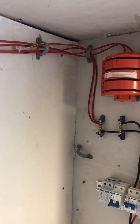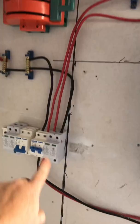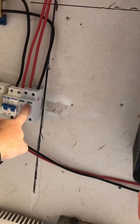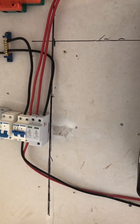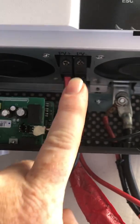My solar power comes in through these four 8-gauge wires here, comes in through this disconnect and feeds into these two breakers. This is a surge protector that can turn on and dump to ground if there is a short or a lightning strike. The power is coming in through these two wires and feeding into the solar input on the inverter right there.